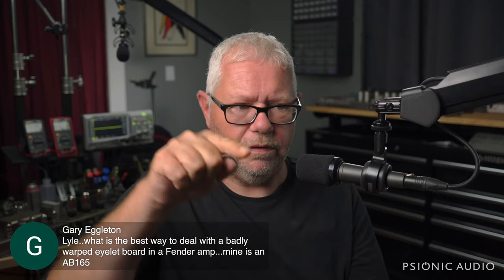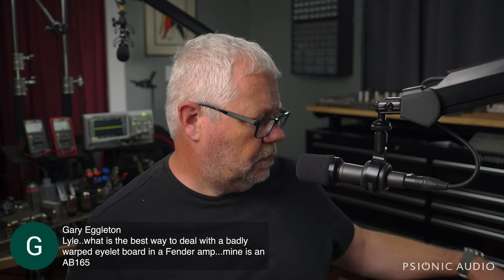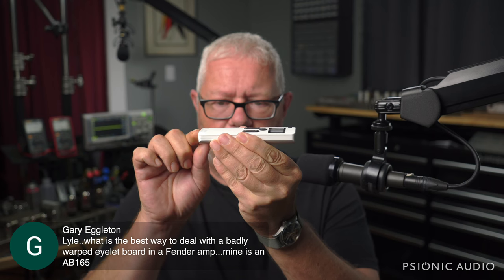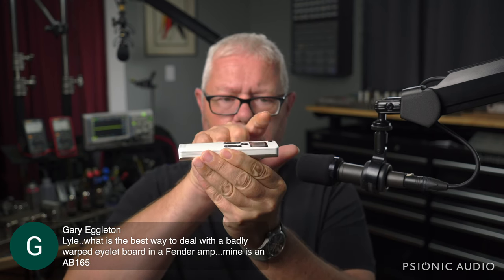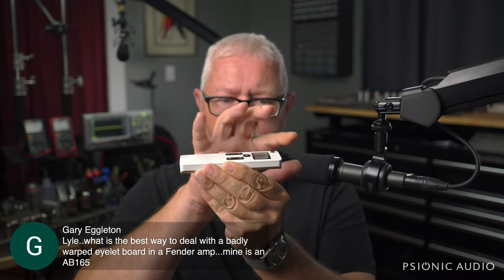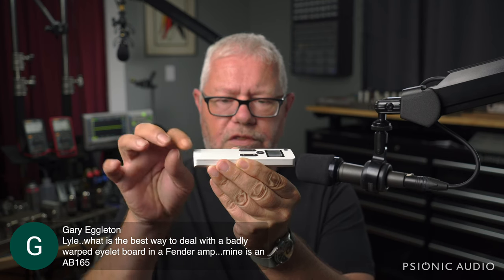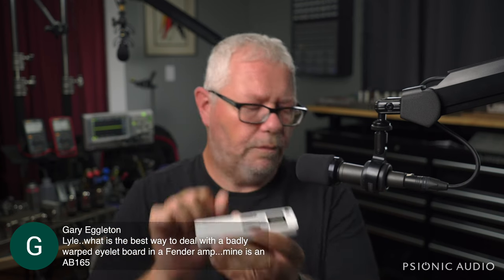So instead of having the resistor lead go into the eyelet and then right across, and here's the resistor and then down, you'd have it do gentle curves up in the air with a little excess. So it's like shock absorbers built in. The resistor would be here and a little bulge here and bulge here. So if this moves, that lead can move with it a little bit, and that one can move a little bit.